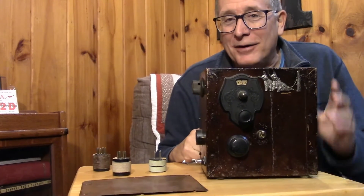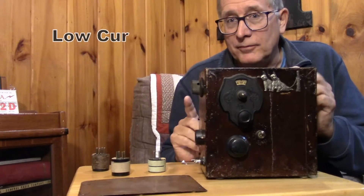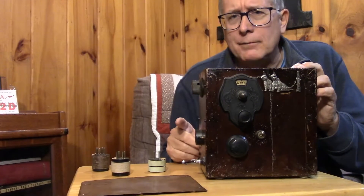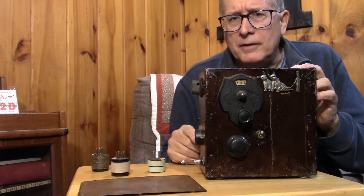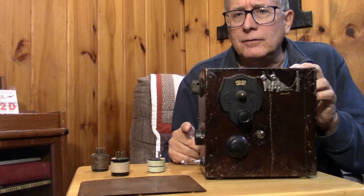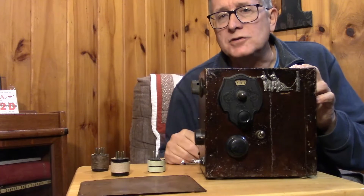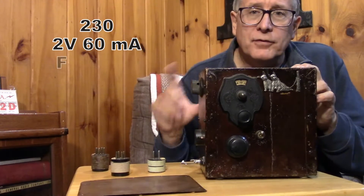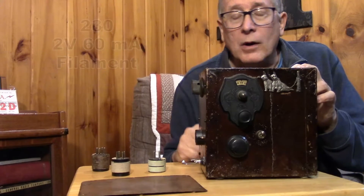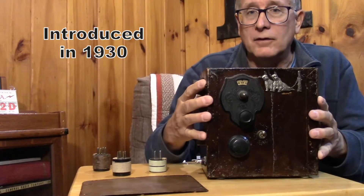This regen uses battery type tubes. The first generally available battery tubes to amateurs show up in the 20s, but by the mid to late 20s we start to get more commercial large-volume type tubes like the 230. The 230 is a battery tube with a 2-volt filament requiring only 60 milliamps, which makes a fully portable radio like this possible.